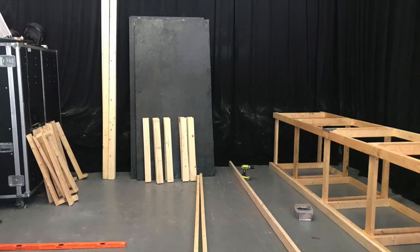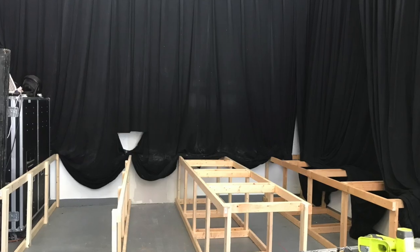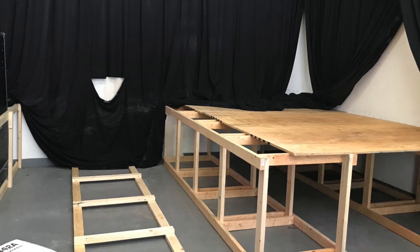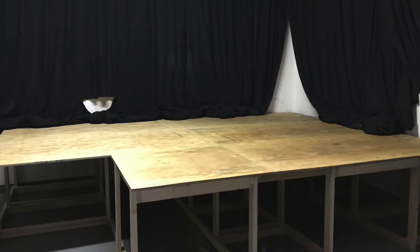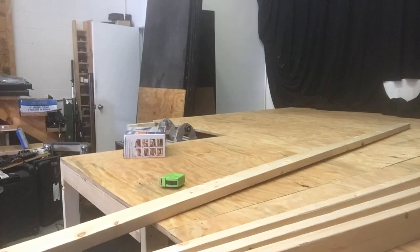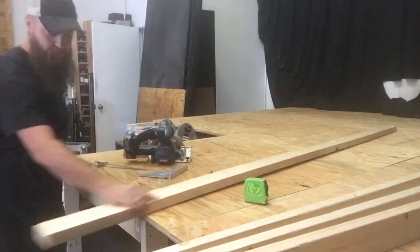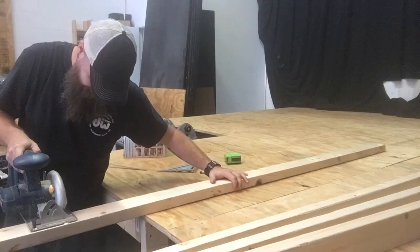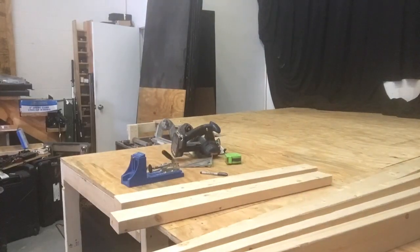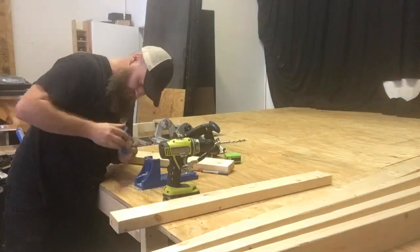There's the beginning of the new frame, which a lot of that came from scrap wood of the old frame and then a bunch of new 2x4s. I built it in these compartment sections so that the floor would be exposed — I could roll stuff under there in between each framed-out section. There's the plywood on top, and because of the way I sectioned out the frame on the bottom, the plywood seams where they met together on top didn't meet up on top of framing, so I had to cut off all these little guys here to basically give something for every seam to grip into when I screwed it down from the top.